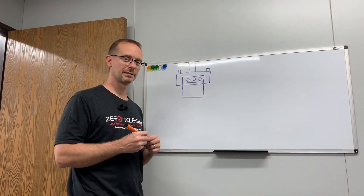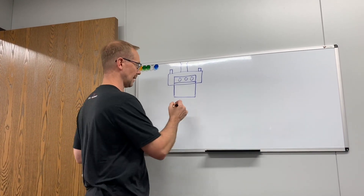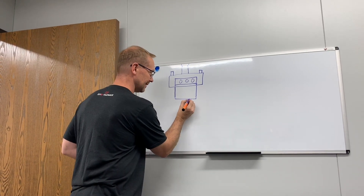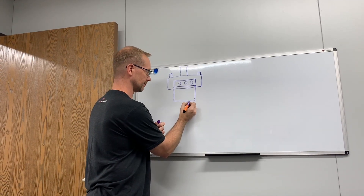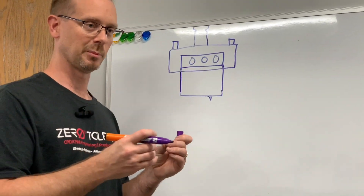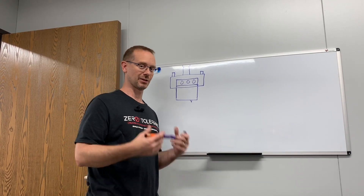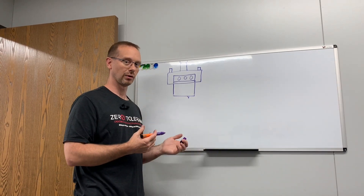When we're burning ribs there are some precautions to take so that your burn comes out clean. What happens sometimes is you get a growth on the electrode — we call it a 'tit' in the shop — where the little particles of carbon actually grow a little extension on the end of the electrode. You end up at the bottom of a blind pocket rib with a giant hole that you won't see. Sometimes they're so deep you can't see it until you make a plastic part and your customer is not happy. So you end up having to fix it — sometimes you have to wire out a pocket and re-burn the whole area or insert it.